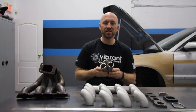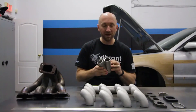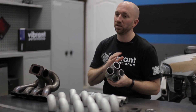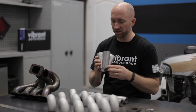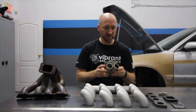Your collector is the most critical part of the turbo manifold, which in itself is a very important part of your turbo setup. What makes it so important is it's going to see the highest degree of heat, pressure, and stress of the entire manifold. All the exhaust is being forced into a small space, which creates a lot of heat and a lot of back pressure in this piece.